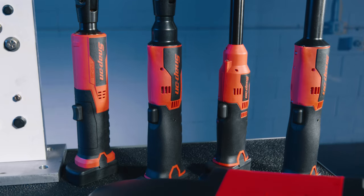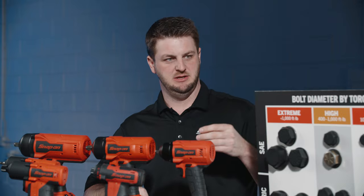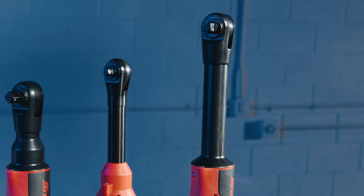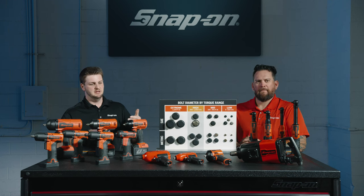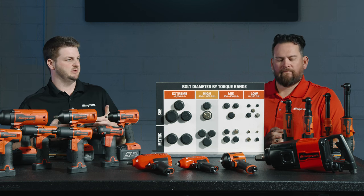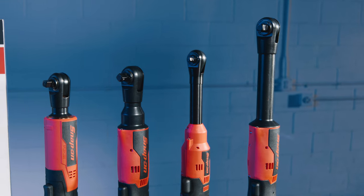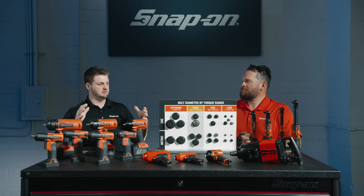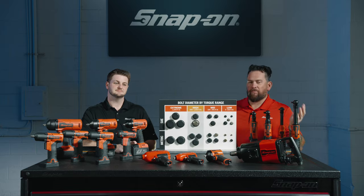Moving over to some diversity — the CTR cordless ratchet family. Just like cordless impacts, cordless ratchets are engineered for a specific purpose. The Brute is designed for heavy torque and low speed. The standard cordless ratchet has more free speed but slightly less torque due to higher gearing. Then you have the long-neck versions for better breakaway and access in both quarter and 3/8". There are so many varieties — think about the torque level you're trying to apply and use the right tool. You don't want to snap heads on low-torque applications, and you don't want to overwork a quarter-inch ratchet on a Brute application.